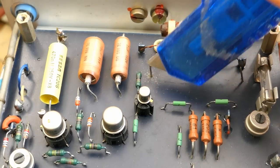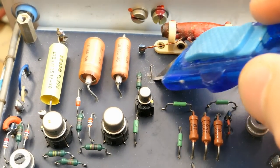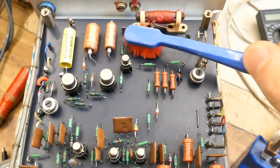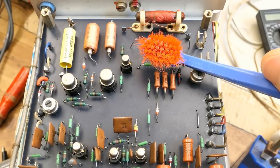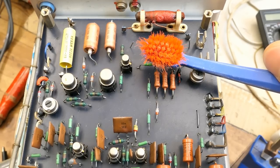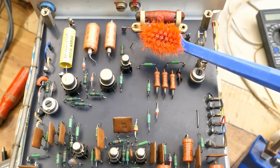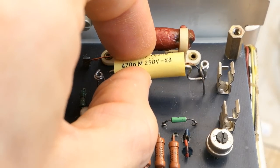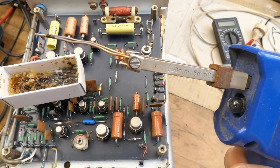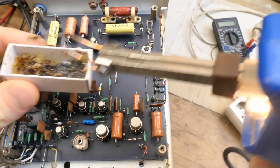I'll replace them with these 470 nanofarad 250 volt capacitors and solder the new ones onto the pins of the old ones. Of course you have to scratch the living hell out of the pins to solder on them — they've oxidized. Cleaning the shavings with my toothbrush. As a child I hated brushing my teeth and wanted my freedom to stop, but now I'm glad my parents didn't give me that freedom or my teeth would be completely rotten. This is the lazy way — some soldering enthusiasts might be getting seizures.